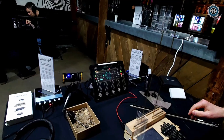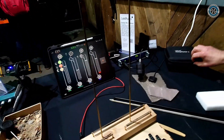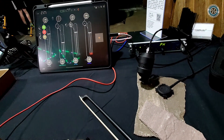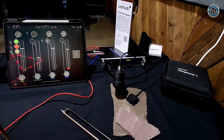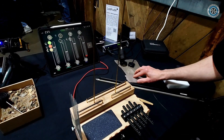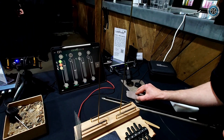And then you've got a couple of contact mics here as well — some additional microphones. We've got this Geophone. It's pretty new. It comes in a box with some different mounting possibilities, like this clamp, suction cup, magnet, and so on. As an add-on, we have this bow holder, and you're able to adjust the angle of it because it is a capsule with a magnetic element normally used in seismic measurements, like earthquake detection. So extremely low frequencies. Yeah, extremely low. And we use it to build microphones from it.